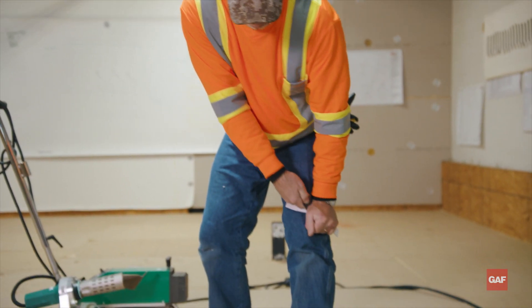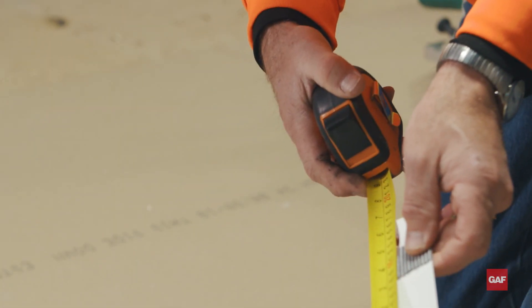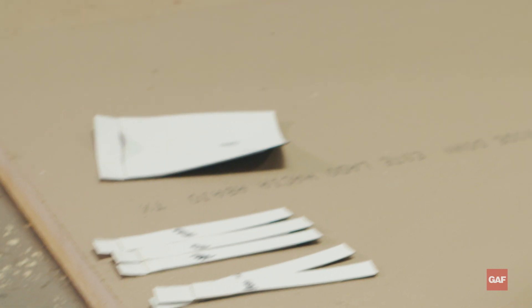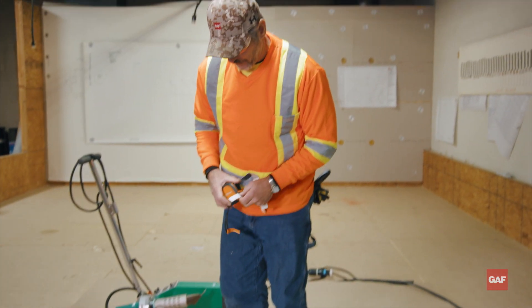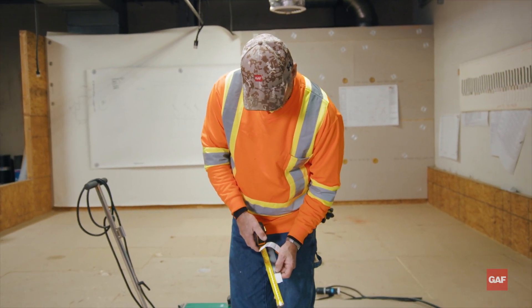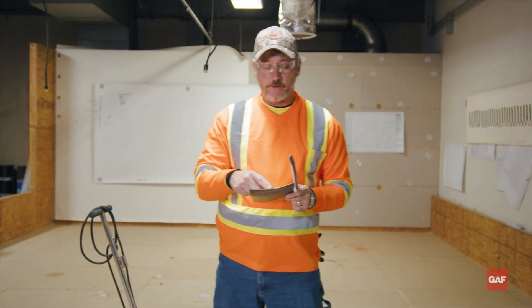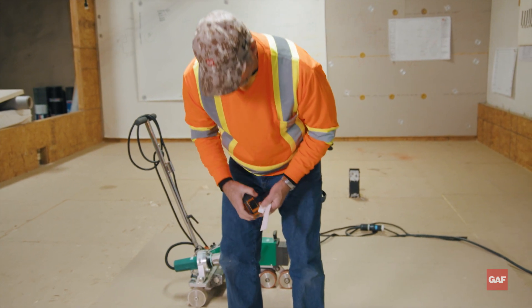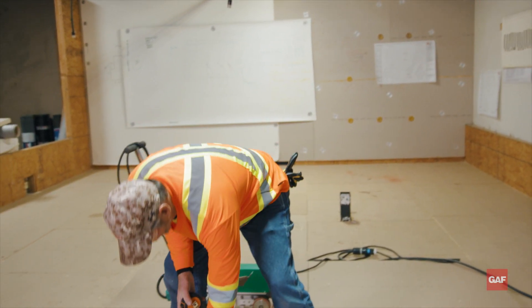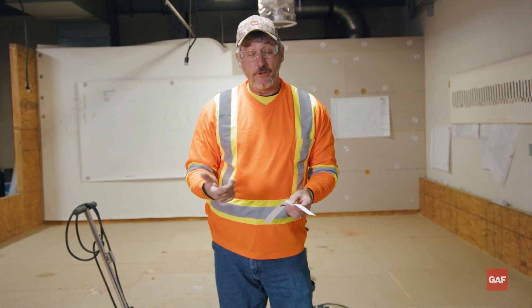Now we're at 800, 900 — again we're at an inch and a half. Now getting up to 1,148 degrees, we've got a good weld at 700, 800, 900. At 1,148 degrees — remember I did the test weld and showed everybody we had gray — we actually overheated this seam. We're still at an inch and a half, but when you start getting up to 1,000, 1,100, 1,148 degrees, remember how I reached back and tried to peel that apart. I couldn't at 900, I couldn't at 1,000, but I could at 1,148. So we already know it's too hot.